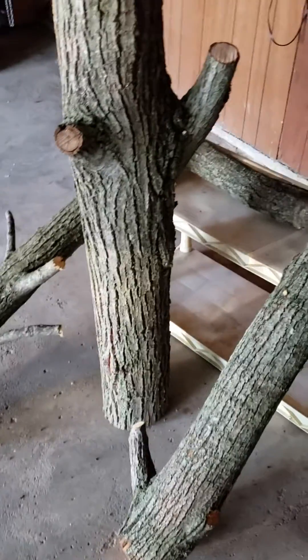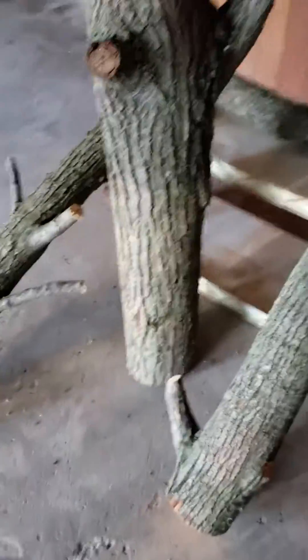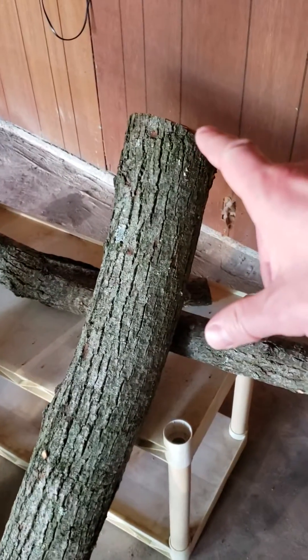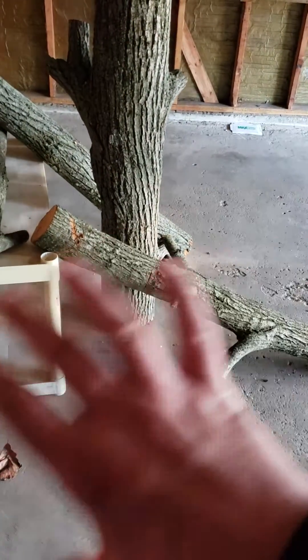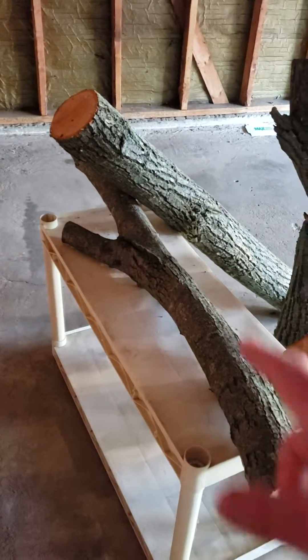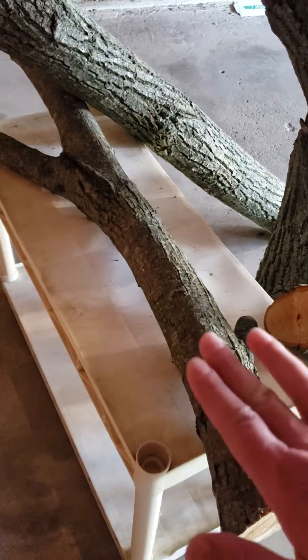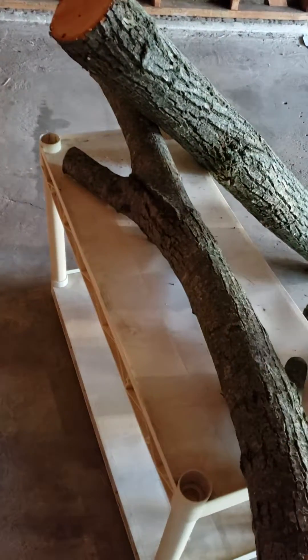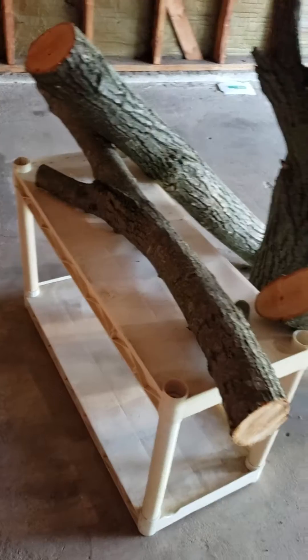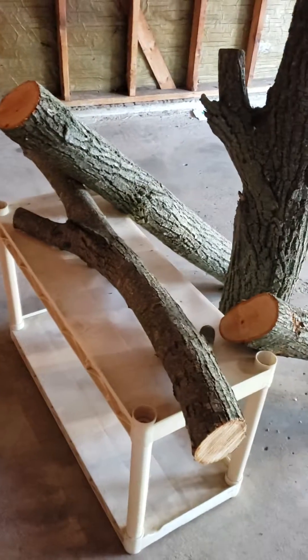Remember: if you make a table like that, set your height first in your drawing and cut your pieces to that exact height. Don't measure the exact length of the wood. You have to set your wood somewhere where it can lay flat. You'll have a zero inch up until your height mark — however it lays when it sits there. I cut accordingly. I did not take a tape measure and run it along the wood, because if you do that you get a little over four feet — about four feet and an inch and a half or so. Hope that helps, let me know if you need more.